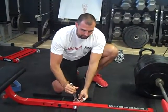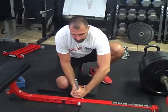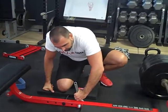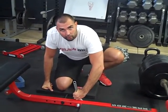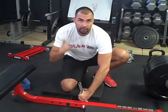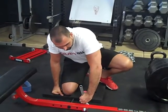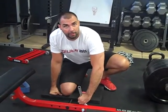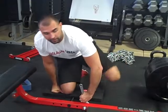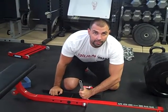If you can think about a wrench — let's say I was trying to use this wrench very inefficiently. I would probably push at an angle really far down and just not use much force. You could see that this wouldn't produce a lot of torque. What are the three ways in which I can improve torque using this wrench? The first way is to improve the angle at which I push upon the wrench. If I'm pushing like this, I want to be perpendicular to this wrench. That way all of my force is effective force pushing straight against the wrench. So I would move my angle of attack to here — now I'm pushing at a perpendicular angle, which is going to increase torque.